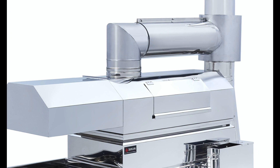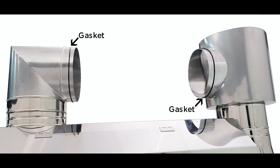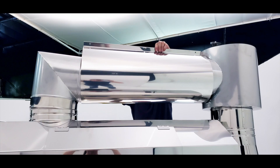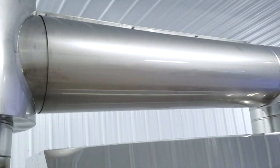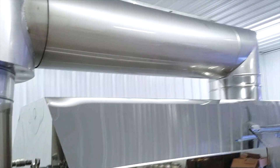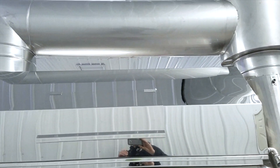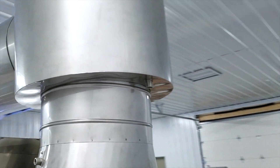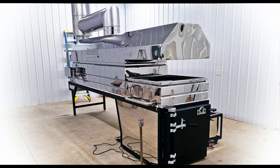Now we'll go back down by the evaporator and install all its accessories. We're going to connect the T of the concentric exhaust to the hood. First, insert the stainless steel elbow into the hub on the top of the hood. Next, place a gasket on the elbow and on the T. Then all we have to do is connect the elbow and the T using a strap stack. The concentric exhaust system is complete. The horizontal strap stack makes an easy disconnect for removing your hood if ever needed during the season. There is sufficient pitch to drain that horizontal pipe into the T, which has gutters built all the way around it and will drain out any condensation that builds up.